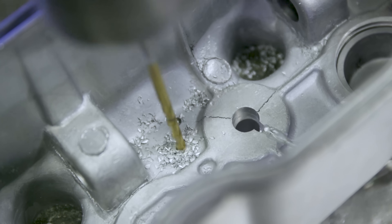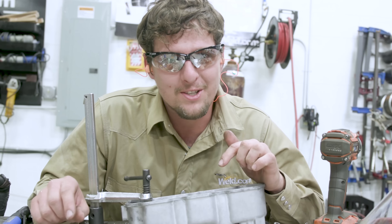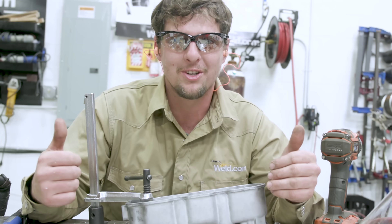On the other end we're going to drill a hole so that crack won't grow anymore. We don't want to drill all the way through — just go a little bit and stop that crack. Looks like we're going to show you how to fix holes too, because I accidentally drilled right through there. But I know a good welder, so we're all good.